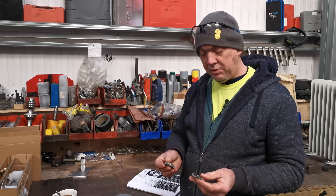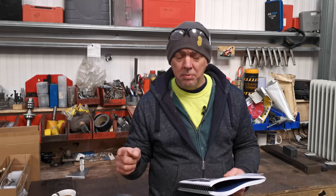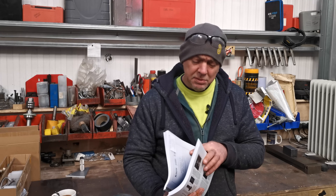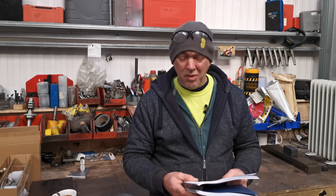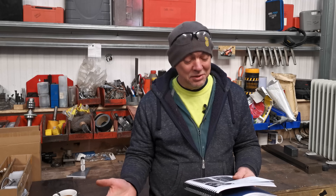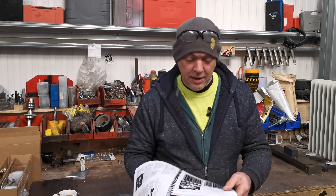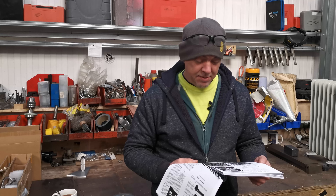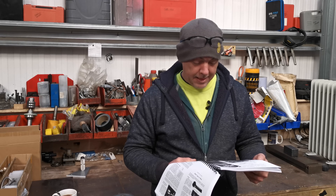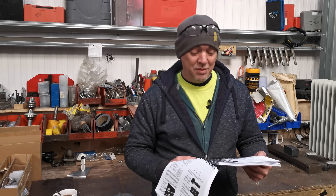These might need a little tidy up, still got a couple of rough edges. I think he does actually make these himself but it's going to work. I've also had a look through my manual - all this stuff is online, you can find it on Mark's Facebook page. I paid for this manual because it's got all the tech specs for everything that Boxford ever did. I just prefer having a book - you don't need anything else to read it, doesn't matter if you lose signal on your phone. According to it I should be able to cut anything from a 6mm pitch down to a 0.2mm pitch, which is pretty good.